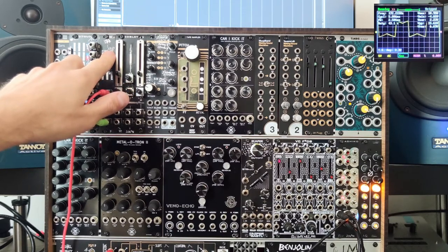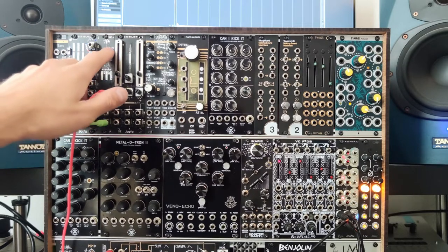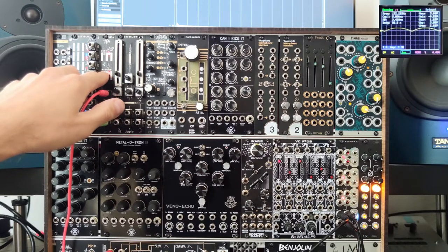Covering the rightmost contacts of the disrupt contact potentiometer increases the amount the wave folder affects a signal. Covering the lower two contact points decreases it. The pieces control affects the pulse width of the resulting folded signal.